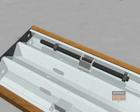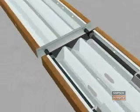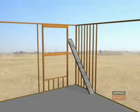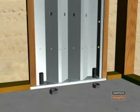After installing the nuts in both places, pass the rods through the top of the wall. Connect the upper wall to the bottom wall by fastening nuts onto the rods over the base plate of the upper wall. All nuts should be securely fastened, snug tight before the structure is placed in an upright position. Place the whole assembly over the anchor bolts, adjust the wall as necessary, and then secure with heavy hex nuts.